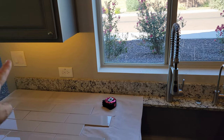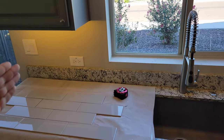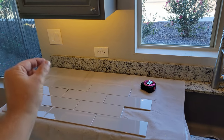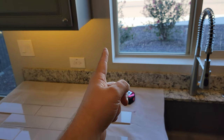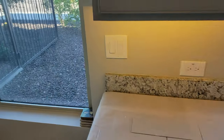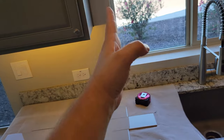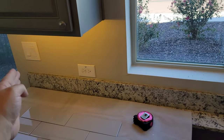So I can fit four pieces of tile from that line to this line. From this grout line I can continue with full pieces, and from this one too — which means I've avoided small pieces on the sides of the window. In this case I measured and we're going to end up with full and half there. As long as the metal jolly trim I put here fits a certain number of full and half tiles, it's perfect. That cover plate stays on the tile and doesn't overlap outside. So full and half from here will give us full and half there.